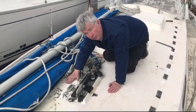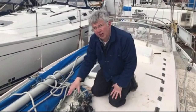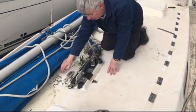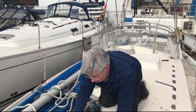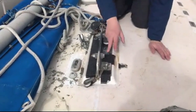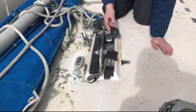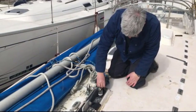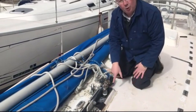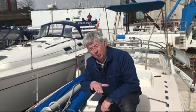There's a lot of bulging on the coach roof on the starboard side. It's possible that water has got in through these deck glands for the wiring, so the coach roof is probably wet inside. That's not helped by the plywood plinth underneath the mast step becoming wet as well. These bolt holes are likely leaking underneath — somebody's covered them in tape because the bolts that hold the mast step down are leaking. In fact, they're actually missing, so somebody knows about the mast compression problem and has been trying to treat it. The mast compression post inside will need to be repaired and the plinth replaced.